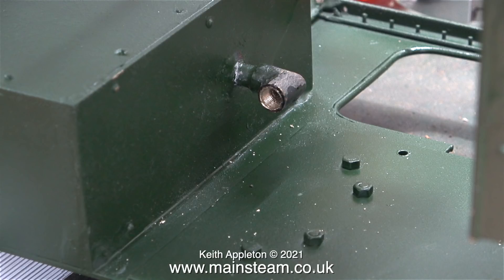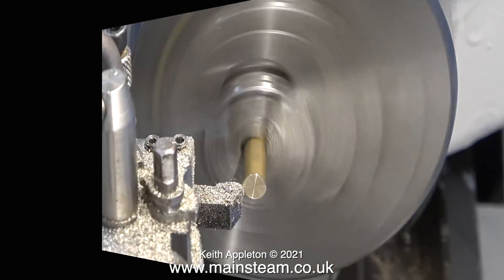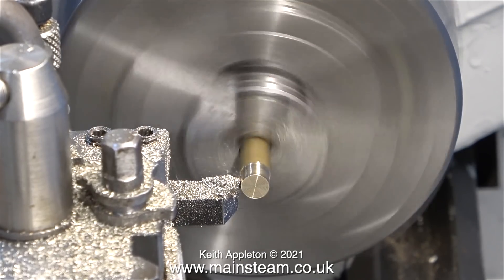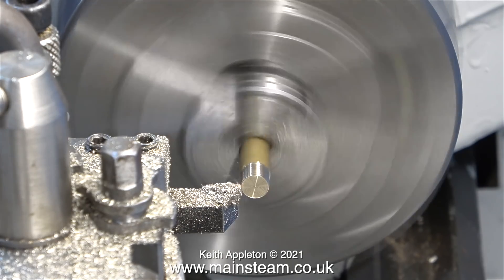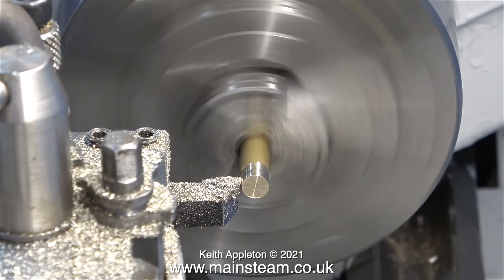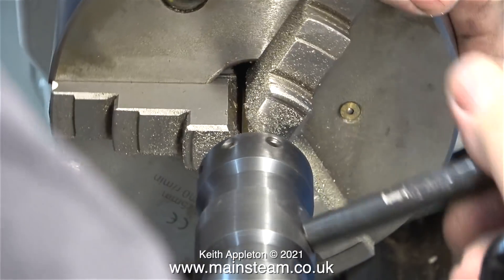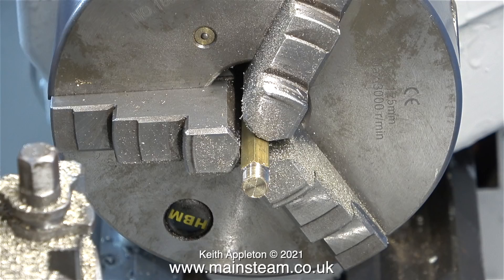All I need to do now is make a special adapter which will be quarter by forty at one end and five-sixteenths by thirty-two at the other end. So it's over to my old Boxford lathe, which currently is still the lathe that I do most of the work on. I've fitted a piece of brass hexagon bar into the chuck and I'm turning one end of it down to five-sixteenths of an inch in diameter. I generally get very close without a micrometer — occasionally I go undersized, but not often. According to my calibrated eye one more pass should do it. All I need to do now is use my tailstock die holder fitted with a five-sixteenths by thirty-two threads-per-inch die, and rotating the chuck by hand whilst holding the handle of the die holder, I end up with a very accurate five-sixteenths by thirty-two threads-per-inch thread on the end of the piece of bar.